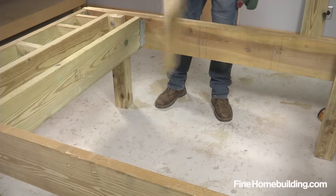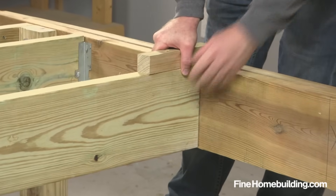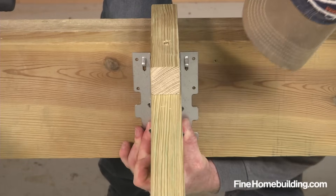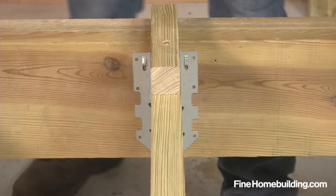To install, align the top plane of the joist with the rim. We're using a scrap of wood screwed to the joist as a brace. Then, snug the hanger up under the joist, squeeze the legs tight, and hammer the prongs into the rim to hold in place.